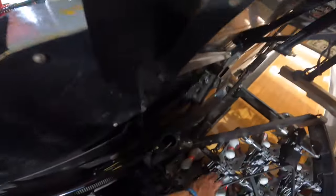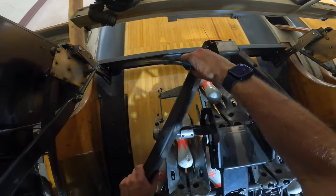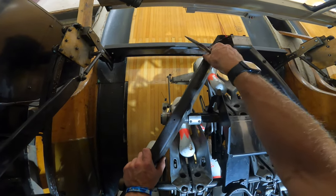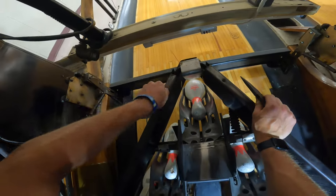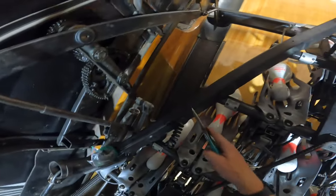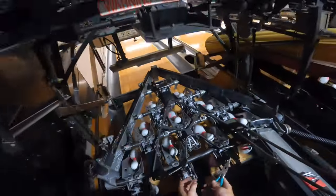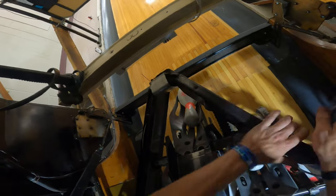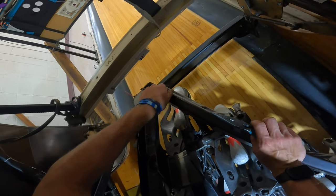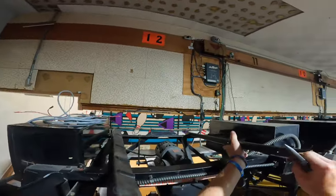The power to the machine is still off. We're back in the back and we're going to take off our covers to the raceway here in the table. I'm using a pair of pliers, but a three-eighths wrench would probably be a little easier. Don't lose the nuts. One side has a broken bolt so there's just the one. We do the same thing on the other side — the back one is also broken there — so we just have the one in front. We take it off and lift the cover to remove it, placing them up on the A-frame.